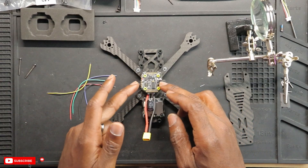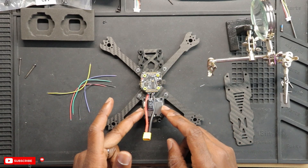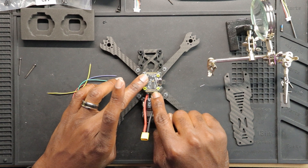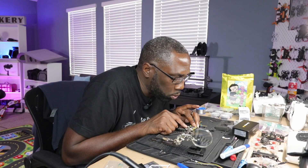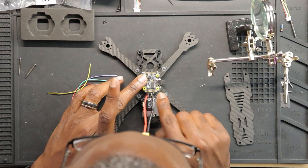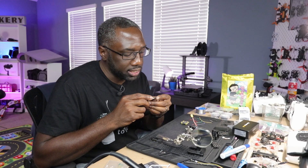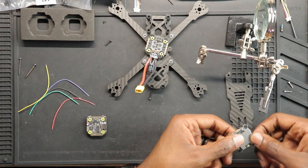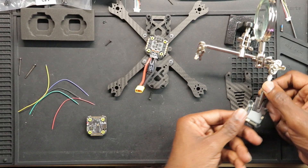If you're wiring it straight to the battery, use a BEC. This flight controller has two voltage outputs: a five-volt BEC and a nine-volt BEC, both rated at two to three amps — more than adequate for this small VTX. I could wire it to the five-volt pad, but since there's a pad made for digital VTX like DJI — I think this is T1 and R1 — I'll just use that. These pads are very delicate with HD Zero; you have to be very gentle.